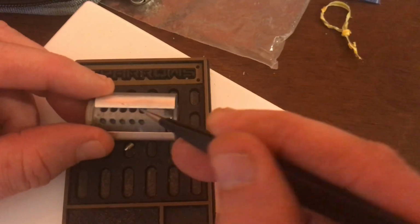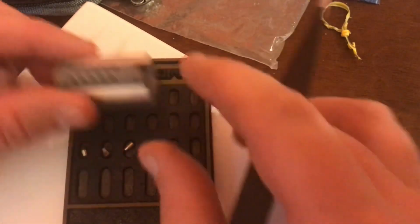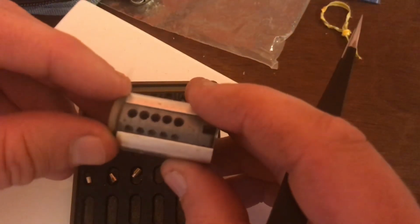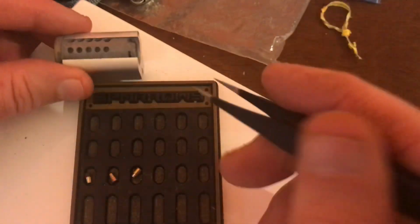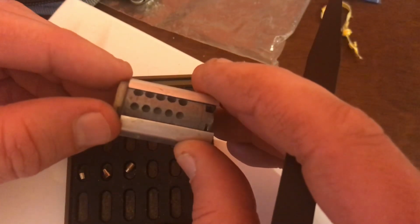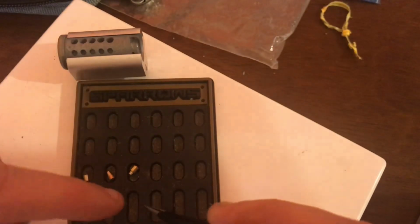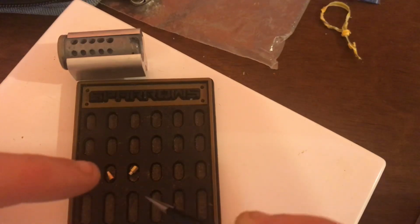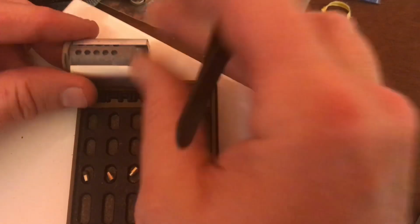But with hard enough lift, the picker may start to get some feedback from this, and they're going to feel a little bit of counter rotation. It's going to be dulled. It's not going to be quite the snappy counter rotation that you get on something like a straight spool, but you'll feel a little bit of feedback. And so you may be able to get the picker to let it counter rotate a little bit, or to counter rotate it manually, and then pop up. Especially if you're running a deep serration or a spool type element on the key pin, if you can get them to pop that up past the shear line, it will drop again into a false set of some sort.